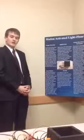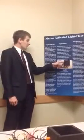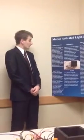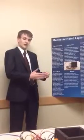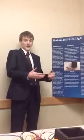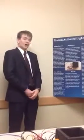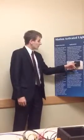The way that this works is that the infrared sensors will send an infrared signal across the box, and what that will do is it will tell the Arduino, which it's hooked up to, that something had interfered with that signal and it's returning an infrared light back, so it will give you a high. And using logical functions, I'm able to determine which LED block to turn on.